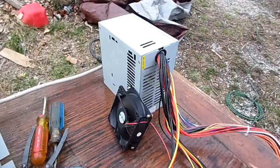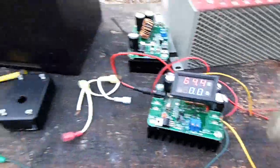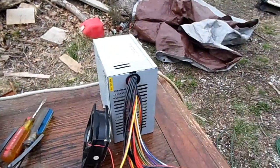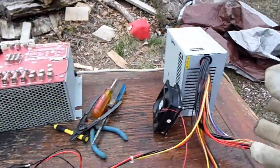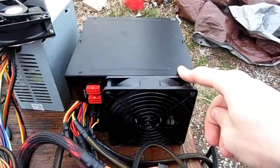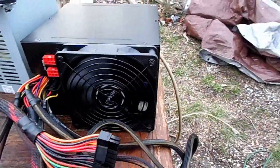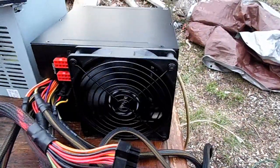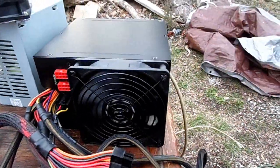That computer ATX power supply is working nicely — it's allowing the converter to put 500 milliamps of current into the batteries, while only being pulled down to 11.5 volts. Unfortunately that is because it has bad capacitors, but it's 14 years old. I have a better power supply inside — it's the big one rated for 22 amps, which is a crazy amount from a computer power supply. It's charging really nicely at a full amp of current on the output end. I'm pulling 5 amps from the 12V side, and it's still not even enough to warm it up and spin the fan — that also means it's a very efficient conversion.